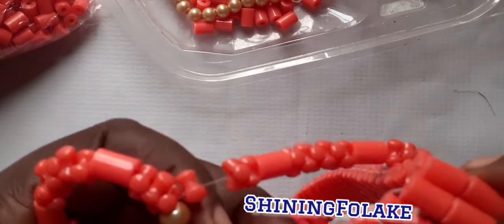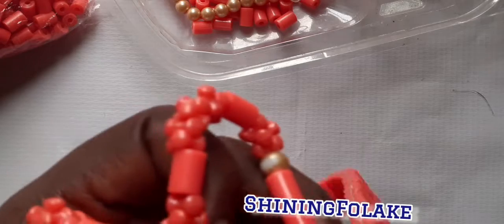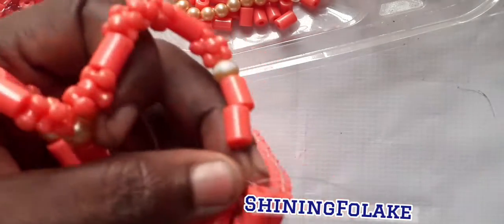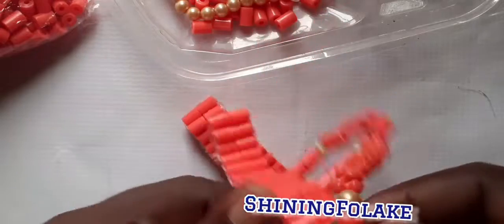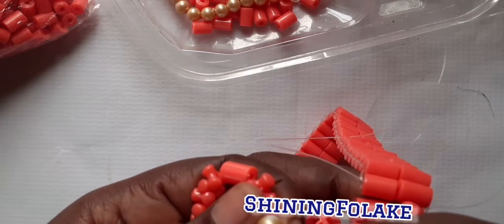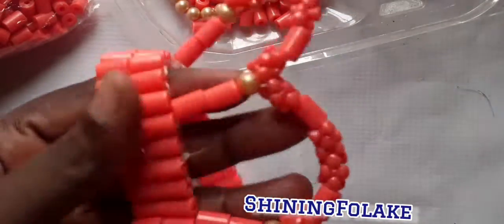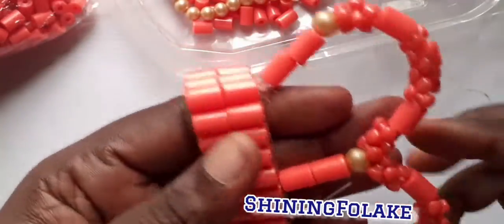You know I count five: one, two, three, four, five. Then again I will have to count five — this is the center: one, two, three, four, five. So I will take it in, go in, pull it out. You take the line again, you have to come out from this one. Sorry, this bead is peeling and it's a new bead. So this is what we are going to do around. I'm going to continue and you see the crown is coming already.